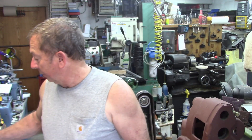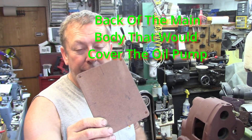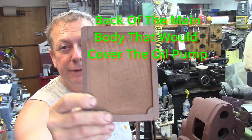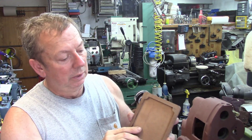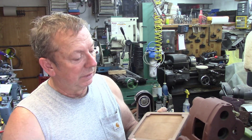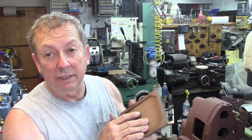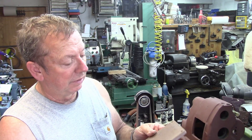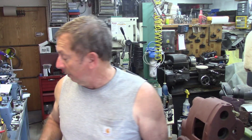I'll give a quick overview and we'll be proceeding with this. I needed the plate that goes on the back of the headstock, so today I spent time building the pattern for that. It's made from tempered hardboard - I laid it out, cut it, and glued up the standoff on the inside. It still has to be sanded, the back filled, fillets added, and edges radiused, but it won't take long.